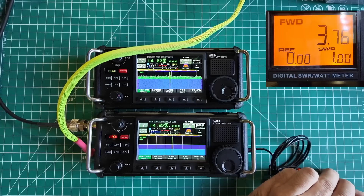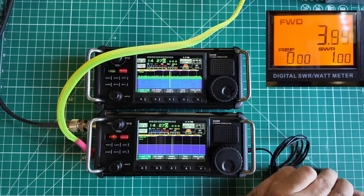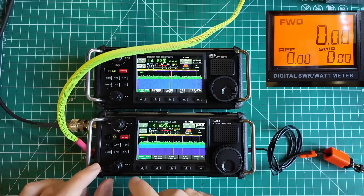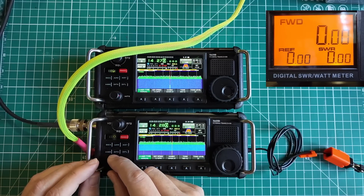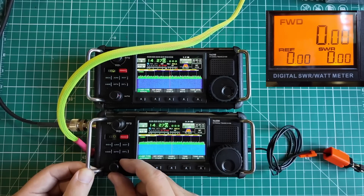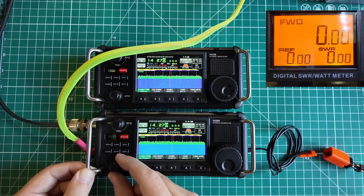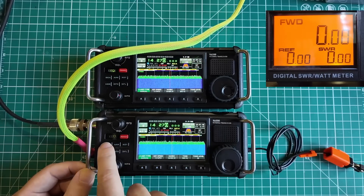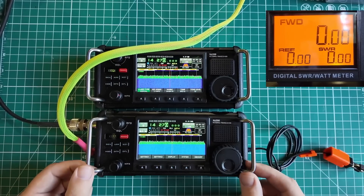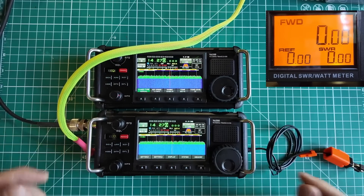The power meter takes a minute to warm up — this is not normal for radios, it takes a little while to get up. We're hunting for four watts and we hit four watts. So we get the rated output power of four watts on the prototype. Now let's change to the outer lower knob for a coarse measurement. It's a little finicky — back to general. Max output power on shore power is set to eight watts.